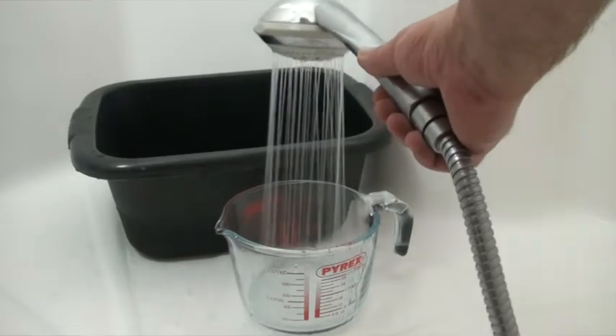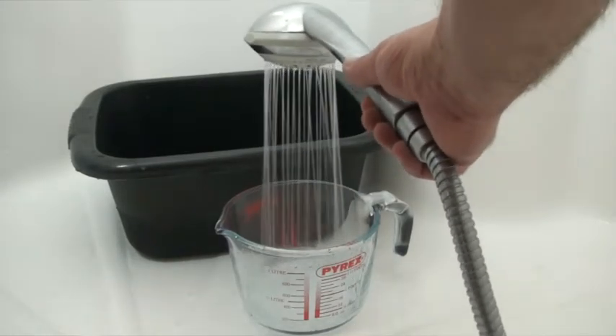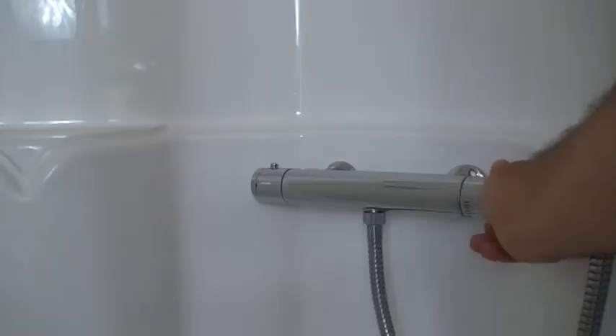But this isn't the case with Flow, because Flow will push the water out of the shower head following the natural direction of the water until there's nothing left but air. And also because there's no dismantling, you're free to enjoy your property throughout the winter months, and then drain it when you're finished. So to drain the cold pipe, the first thing we need to do is turn the shower all the way to cold. You'll also want to lift the shower head down to stop any water running back into the mixer block. Then when you're ready, you simply turn on the shower. When the pipe is drained, just remember to turn the shower off again to seal the system once more.